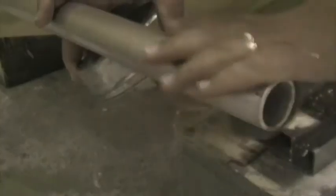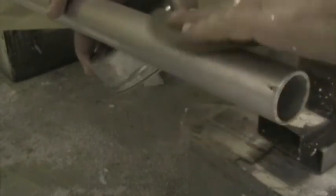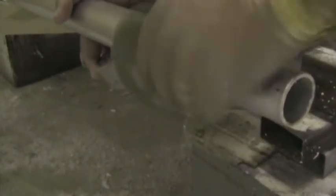We're now going to set up the wings with this tube in position and bond those composite tubes into the wings. Then we're applying release wax to the end of the tube so that it doesn't stick up with the composite tube that's going to go over there. I've closed the end of the composite tube with packaging tape to prevent any cotton flock going in there. And the outside of the tube has been roughened. The hole in the wing we've made oval and cleaned up down onto the lower skin. You can see where the fiberglass has been roughened, and done the same on the top skin to get a good bond between the composite tube and the wing skins.